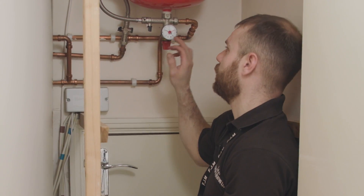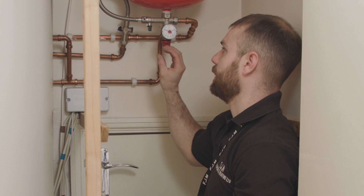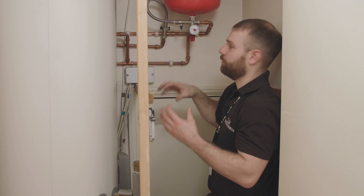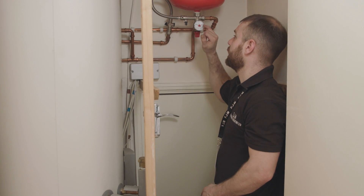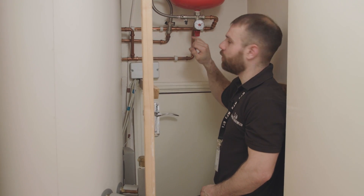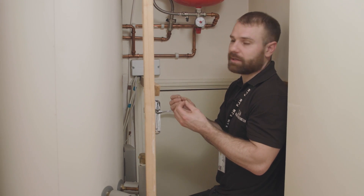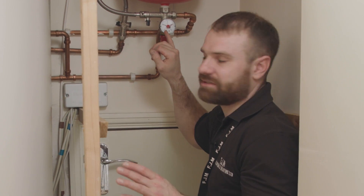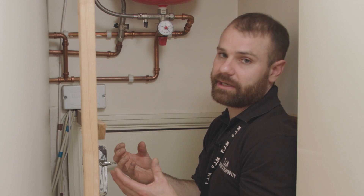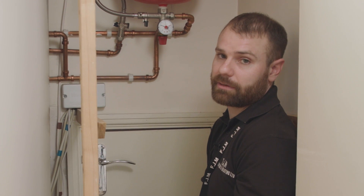Remember to turn the taps off — if you don't, that pressure will keep rising, go around to three, and could end up causing issues. Make sure you turn both taps off. Once you've done this you're okay to carry on using your heating system. If there's a leak, that pressure will actually keep dropping. If it keeps dropping within a couple of days or weeks, it generally indicates a small weep or airlock in the system. This should only need to be done once a year or every six months maximum. If you're having to do it more often than that, give your local gas safe registered engineer a call to come and look for you.